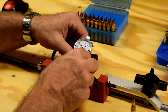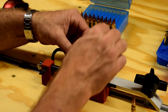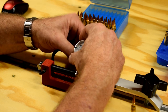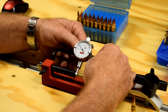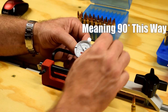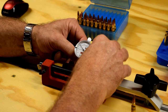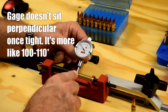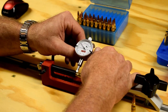Because what that does when you pull it over this way — run this other lock nut out — it wants to push the gauge back past 90 degrees. So you've got to run it out just a little bit farther than you think you would want it. You pull that over. It's not quite where we want it. That's right on the shoulder.